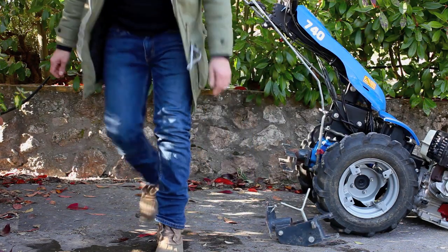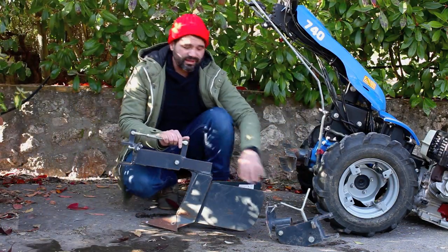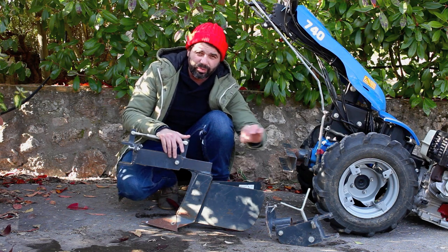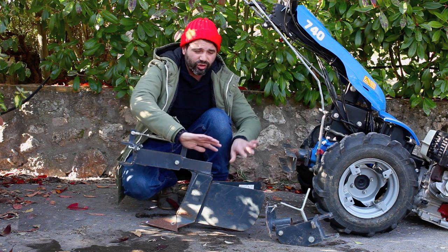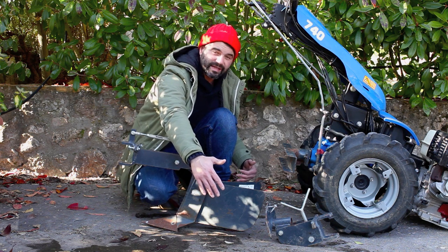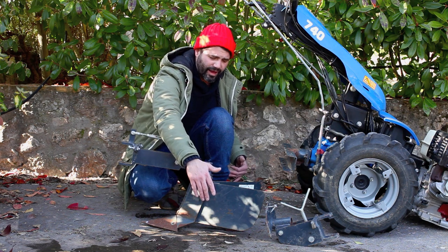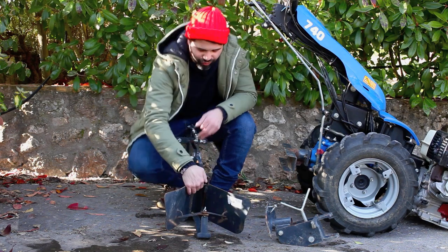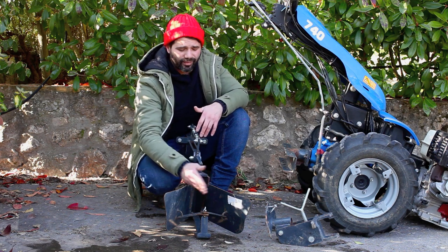The first tool is a hiller. You can use the hiller for all sorts of jobs, not just hilling. You can close the wings and make a ditch through the soil — useful for drainage or planting potatoes. Once the potatoes grow up, you open the wings wide and hill them. You can also control weeds by pushing soil in between plants if you're growing sweet corn. However, when fully open it won't really reach the maximum spacing of modern corn, which I believe is 32 inches. This is a high quality tool made by BCS, though I did have to re-weld where the pins hold the wings on — the original welding was a bit crappy, but it was just a small repair.